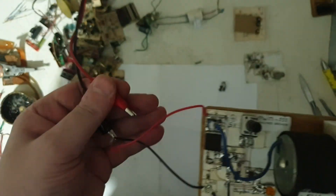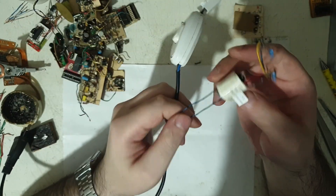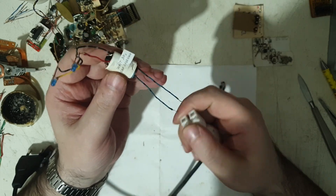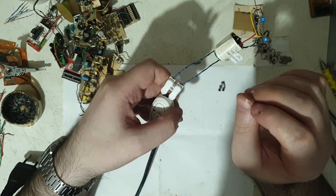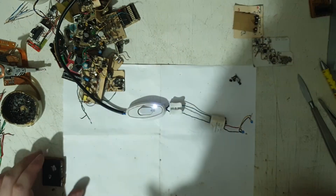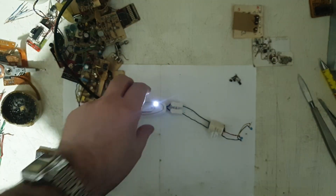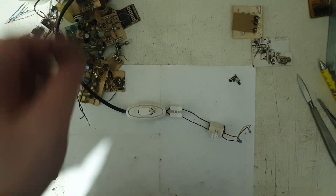Finally, this is a 220V blinking LED circuit using a transistor. It says here I used a 500 microfarad capacitor but you really need 1000 microfarads for it to work — I scratched my head for a long time over that. It won't work from the start; you have to wait about 30 seconds for the capacitor to charge. After that wait — look at that, absolutely blinding! The power LED is fantastic. Now closing it off and done.